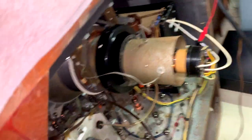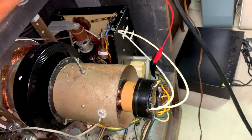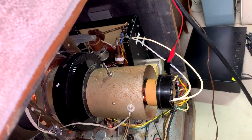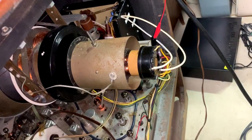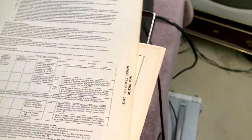That control is almost at minimum. Slide the yoke back forward. I did the field neutralization coil and got that perfect — purity wasn't bad to do. For static convergence, those three screws I'm showing are actually magnets, and that knob screw in the middle is just to lock it in place. You have blue and green on the left, red on the right. Going by the Sams manual, when I started off they were all over the place. Now as you can see, they're exactly as the Sams describes — a perfect little triangle of blue, red, and green.